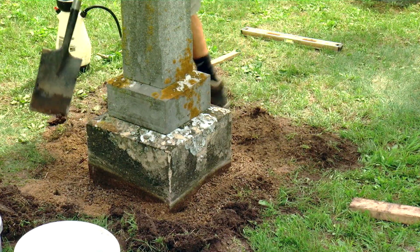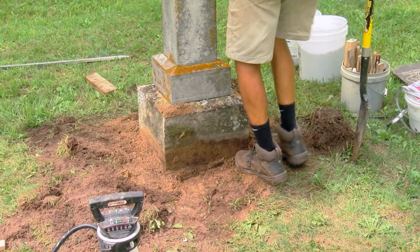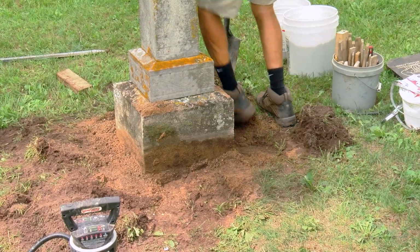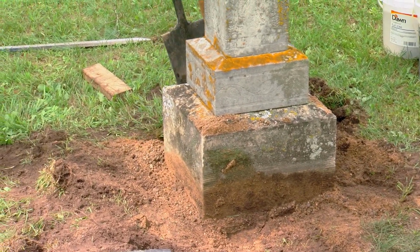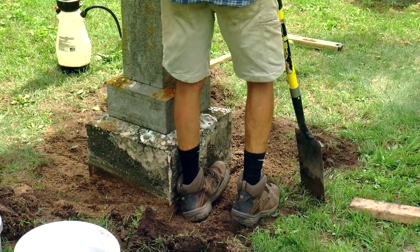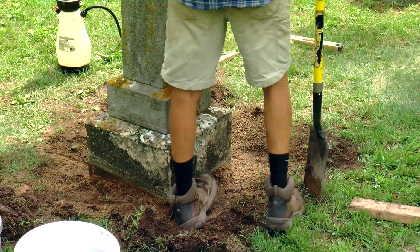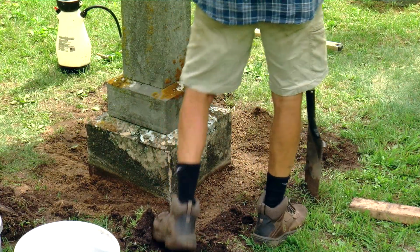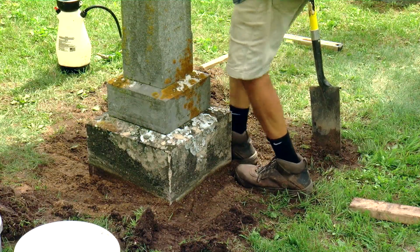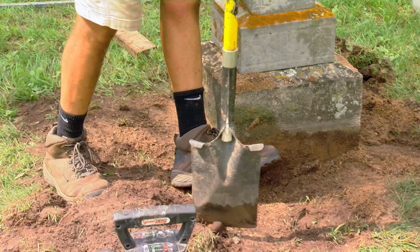Looking good, that's well tamped. So now we're gonna come in and regrade. Some people use like a 4x4, hit it around the edge, that's fine. A regular tamper won't really work unless we take it all apart and make a pad, because they're at least 8 inches wide usually, and there's nowhere really to tamp it with that much width.